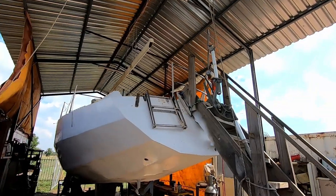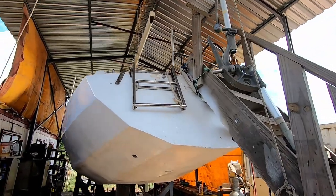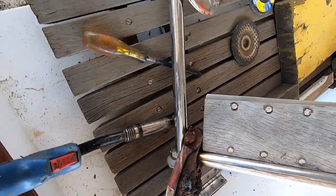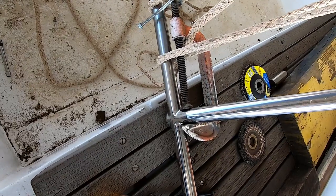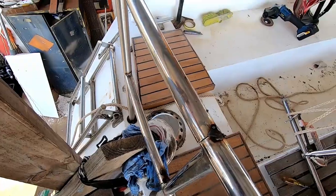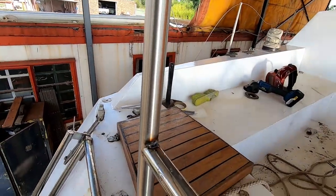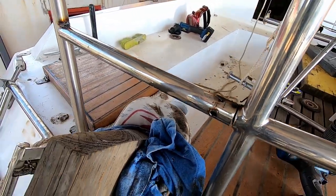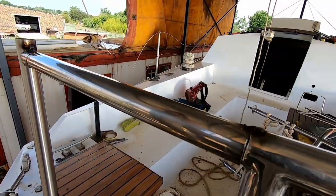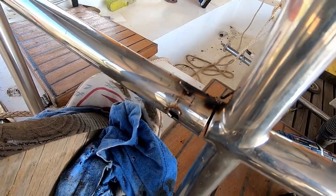As you can see, we're busy with the rails at the back. The ladder used to be in the center — I've tack-welded it at the top there. I'm using G-clamps and ropes to get the surfaces together so I can weld it. There's an old gap I've tack-welded the plate into place. Once I've got everything lined up I'll take it all down and get a better welder to finish it, because welding thin stainless steel is not so easy.